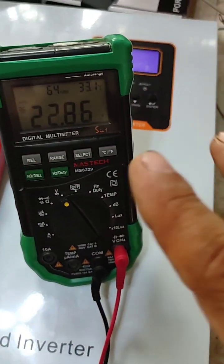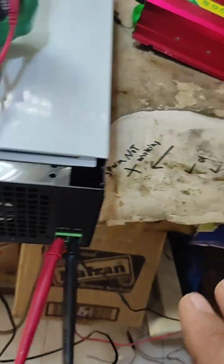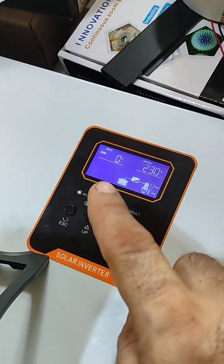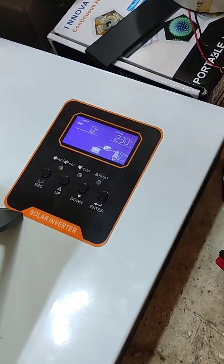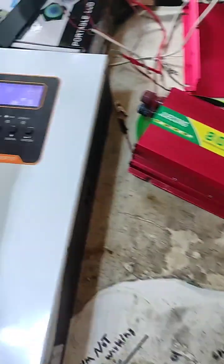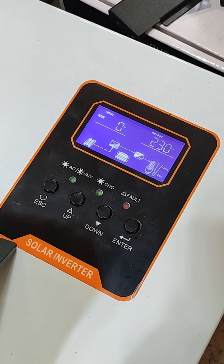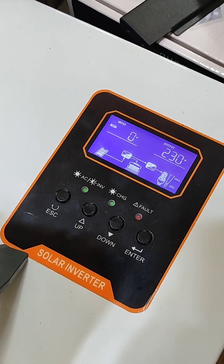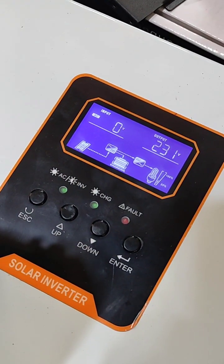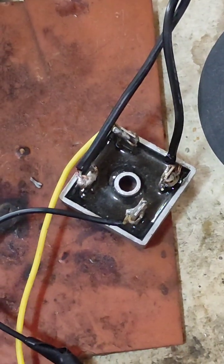26.74 — here the multimeter is connected to the PV input, and right now we have not yet connected the PV input. Let's connect this rectifier and keep an eye on the display — 1, 2, 3. Okay, you see it starts blinking when I connect this one. The PV input has started and it's now charging.